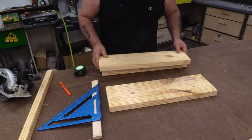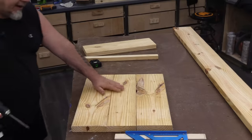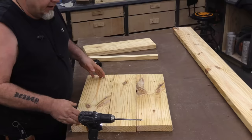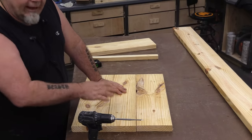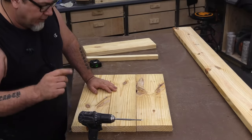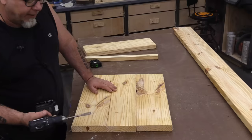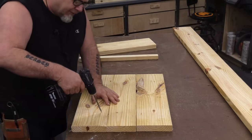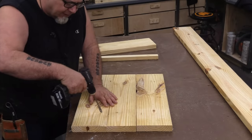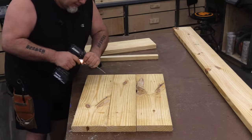I'm going to put my short piece in the center. I want to connect all these boards so they're nice and solid to each other, and I am going to put legs on here and an apron. You don't have to put this up on a stand, but I want to be able to get underneath it to get to the worm tea — I'll show you what that means in a minute. I'm running some pocket holes using a half-inch spade bit, starting about an inch and a quarter back, then tilting it at a severe angle. I only need a couple of these.